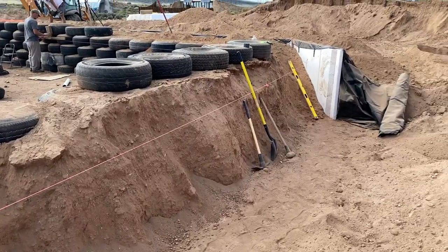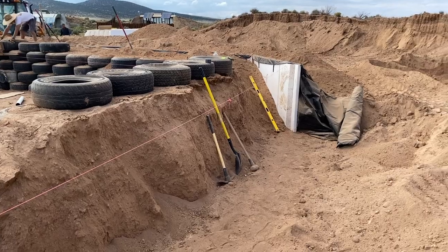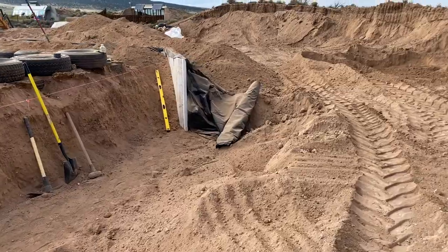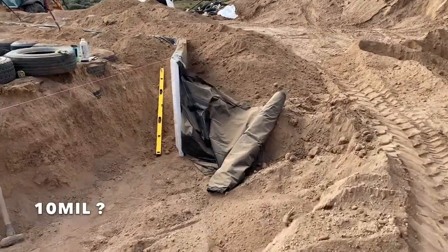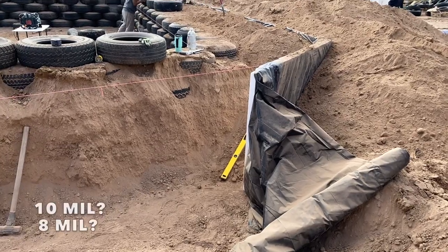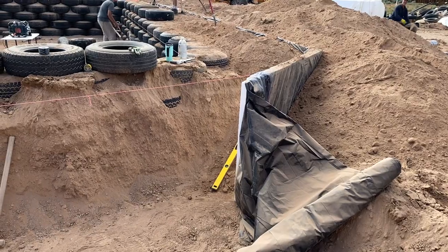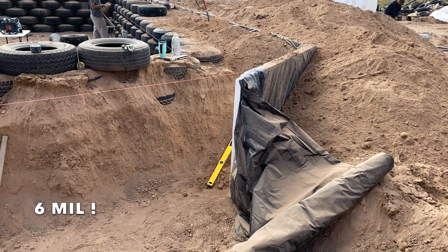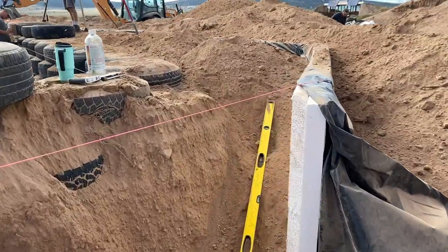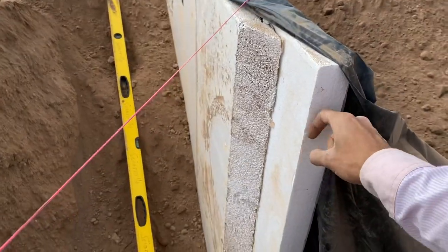Basically in the Earthship, you want to keep the heat inside the building, so you're burying panels of insulation in the ground, which are getting wrapped double ply in 6 mil plastic — doubled — and then wrapped over this sheet of expanded polystyrene, which is basically just foam.